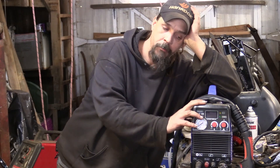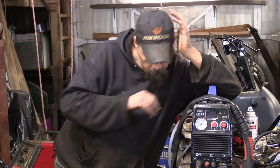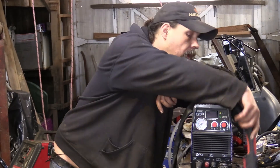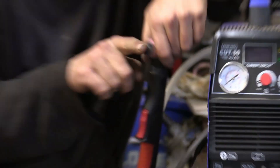What this uses is 220 or 240 electric. You can also use 110, but they'll wear out real quick. It uses compressed air. What happens is there's a high frequency arc and compressed air, and it superheats the air and the metal and blows it out of the way.